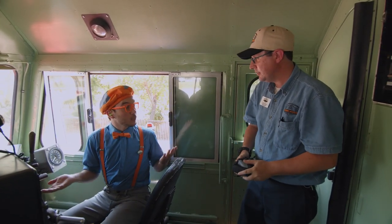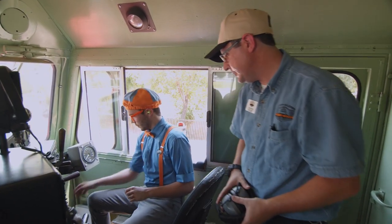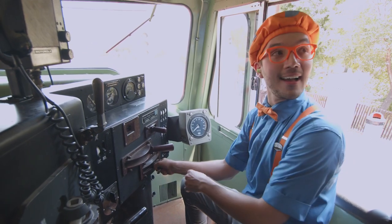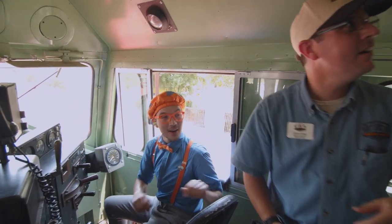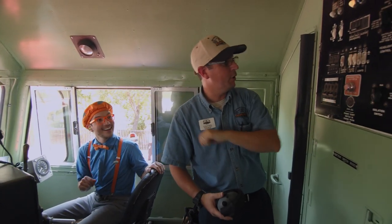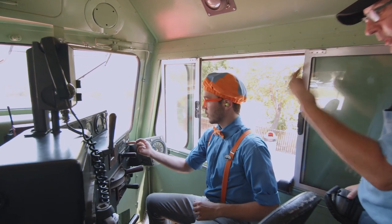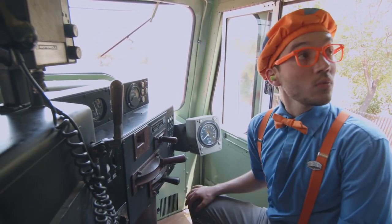So how do we operate the locomotive? So first, we're going to take that reverser key. Yep, go ahead and stick that in its slot again. First. Yep. All right. Go ahead. Actually, there's a few other steps for me. Okay. Sorry. A few other lights. Put it in run so it'll actually go somewhere. Those two switches you flipped earlier, that middle one, Genfield, go ahead and flip that up. Okay. Now the locomotive will send power to the wheels.